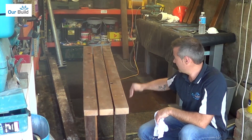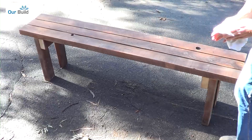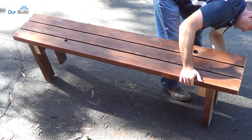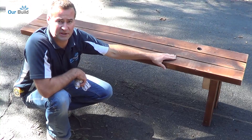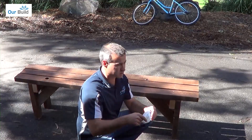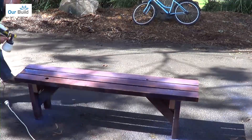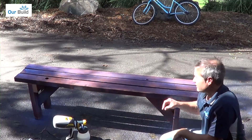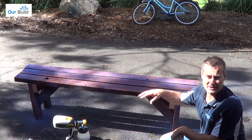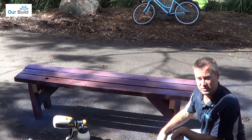That's all you really need — just rub it back. Get rid of the dust off the top, then give it another coat with the spray gun. I'll give it a wipe with a damp cloth to remove the remaining excess dust, put it out in the sun to dry for a couple of minutes, then give it another coat of poly. I've put that on nice and thick — it looks a little milky until it dries. We'll wait till that dries, give it another light sand back, and give it a third or even fourth coat depending on how glossy we want it.